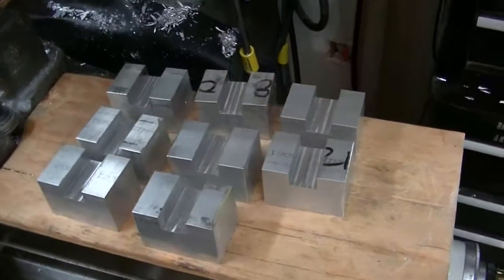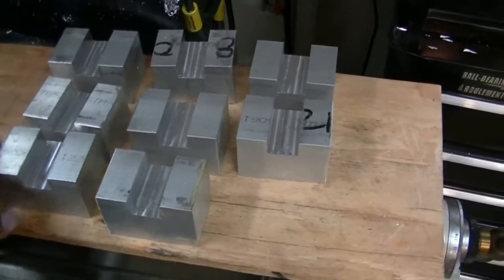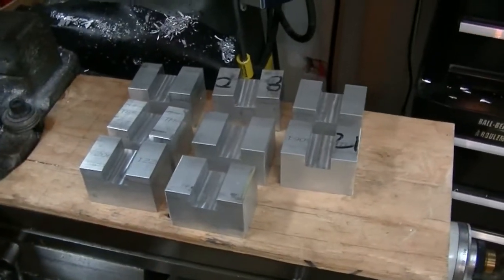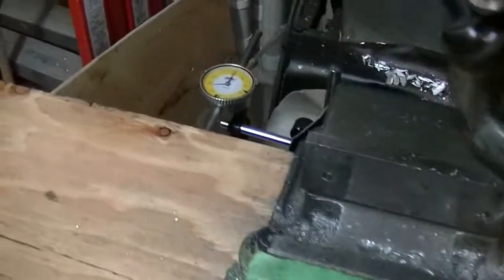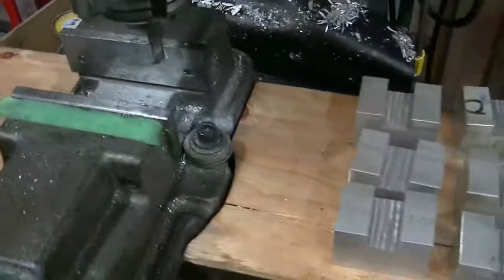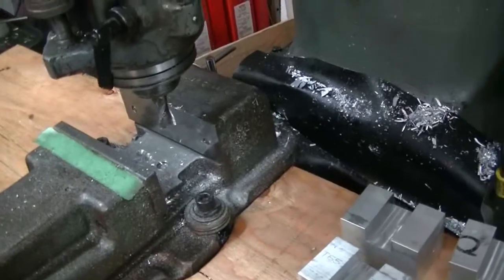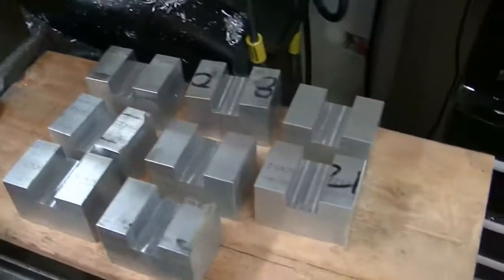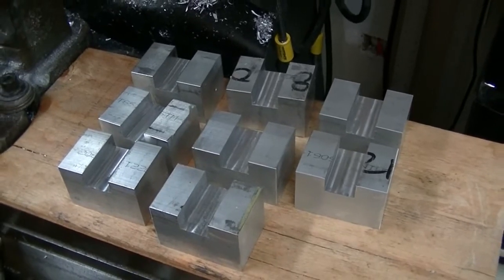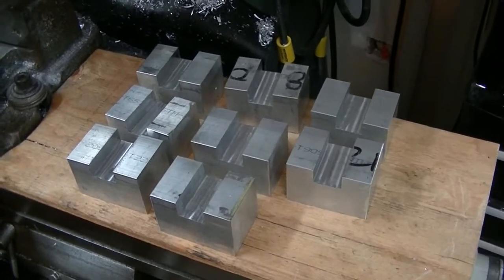So there we have eight pieces all done on a mill with no digital readout, all within very close tolerances - good enough for what I'm doing. There once again is the dial indicator. Use the back of the jaw of the vise as your reference, take into account the diameter of your tool, and then take your time on your first couple, and once you get comfortable, let it rip. If you like, subscribe. Please give me any tips either on filming or on technique if you have any. Thank you.